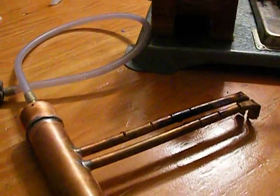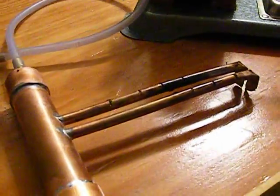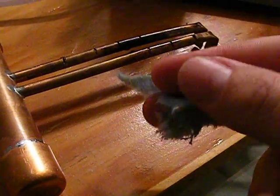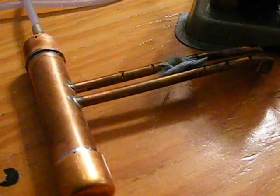I have found a trick to lighting these burners. These burners need quite a bit of preheating, and unless you're going to play a torch over them for several minutes, it's kind of difficult to get them lit. So all I do is I take a scrap of heavy paper towel, stick it there between the tubes. Soak that with alcohol and just light it. I shove it under the engine, and within a minute I've got full flame. It works really well, gets the burner going, gets it heated, and it's off — no fuss, no bother.